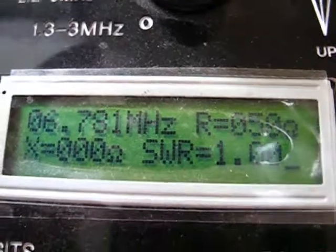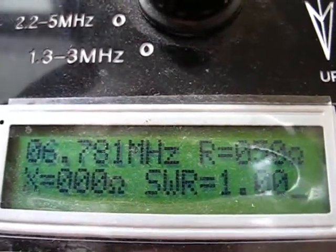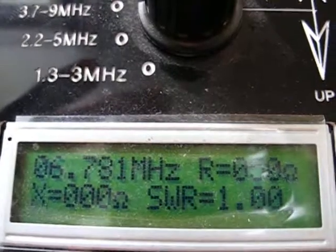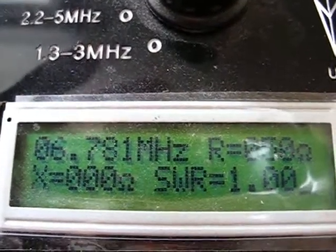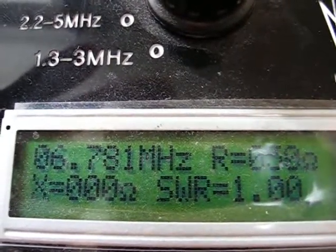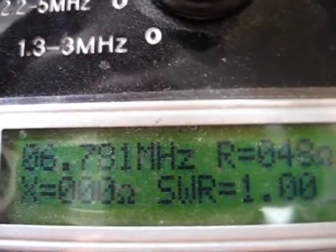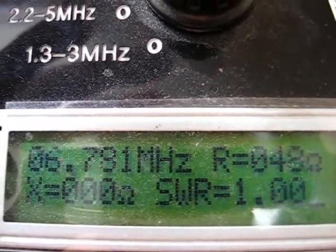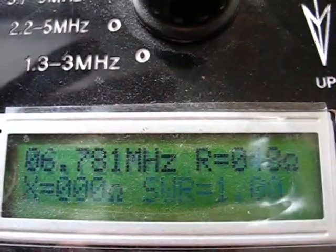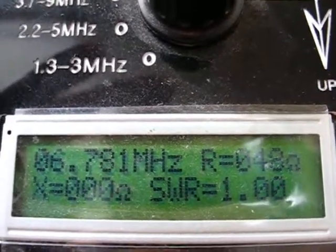I have a very low delta loop and I did have it on 40 meters. I do have a horizontal loop which works quite well, but I thought I'd experiment with a very low delta loop. Well, on 50 ohm coax cable it was quite resonant, but I want to have it on 75 ohm like my other antennas. So this is with a 75 ohm on, but I want to get it now on 20 meters — see how it performs on 20.